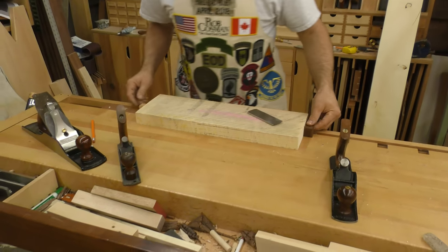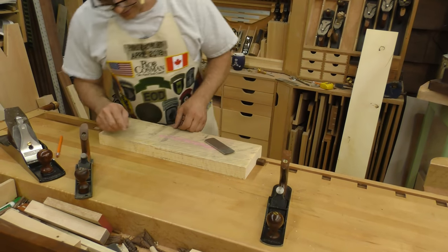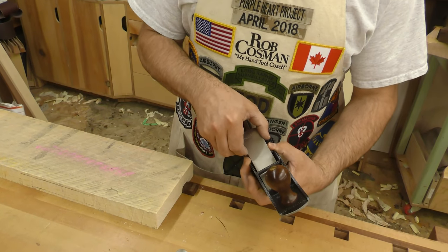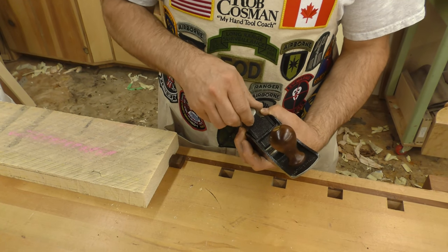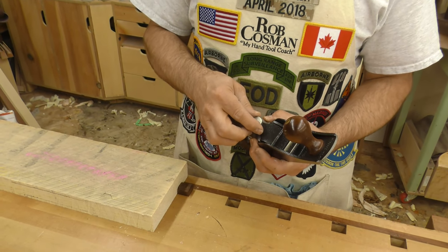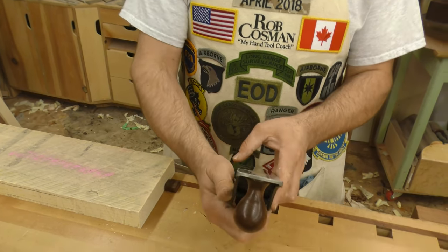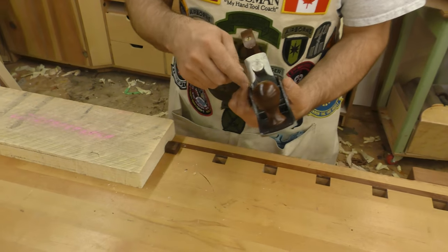Now I'll make sure that this is held firmly in place — this tends to be fairly aggressive. I've got my guide over here. I'm not going to do the whole thing, but I'll just give you a quick rundown on how you do it. Take the lever cap off, put the blade in place. I like to hold it like this with my fingers — there's no advance and retract mechanism on this. Simply slip the lever cap in and snug that up. Now I'm going to sight that down the sole. I can't see the blade yet, so when I release the pressure of the lever cap, I can just slide it with my index finger and thumb. Now that's not enough — bring it a little bit further. See where the blade is: try to keep it centered. There's a lot of room; the blade is not nearly as wide as the opening. There's a big open throat so you can get shavings out.